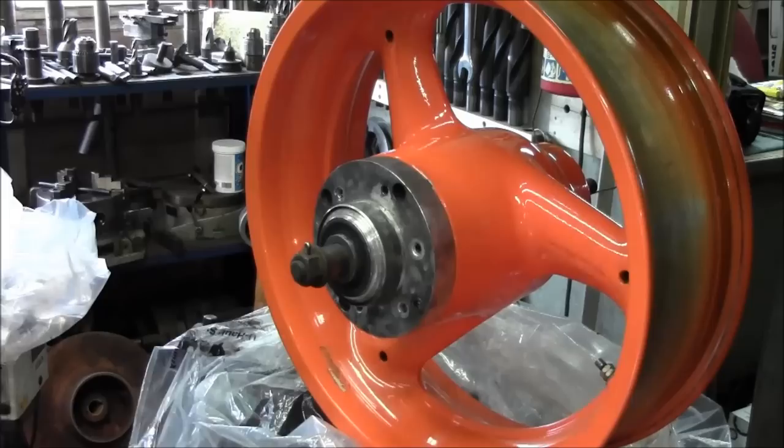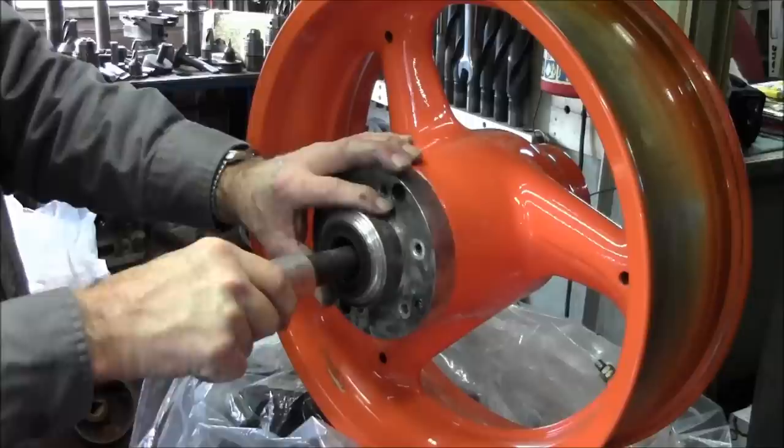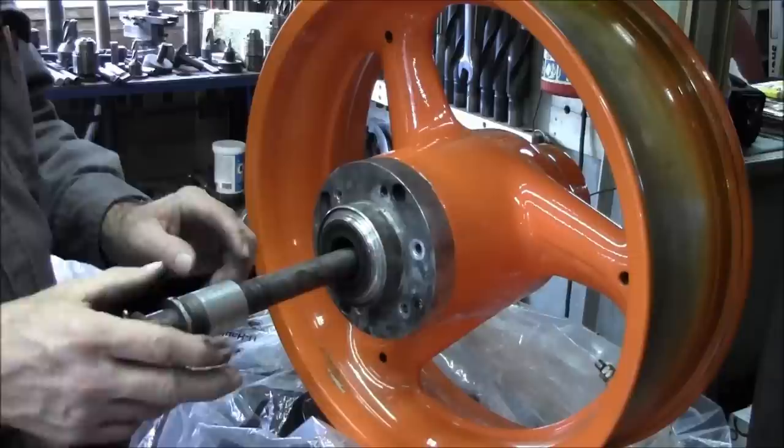All right, we pulled the sprocket. We have a nut off on that side over there, and the shaft comes out this way here, and the shaft is stepped, and it's got a couple different shoulders and some sleeves in here we're going to have to be working with as well, because this sleeve right here goes inside that bearing, and that bearing is already spun on the sleeve here. All right, so we got some issues with that there, so we're going to be pulling this off of here, polishing up the shaft. We're going to check the shaft for straightness and sizing and dimensions and all that.